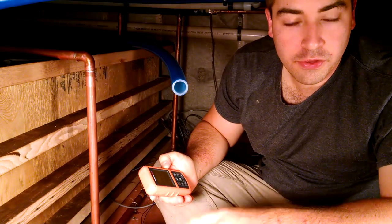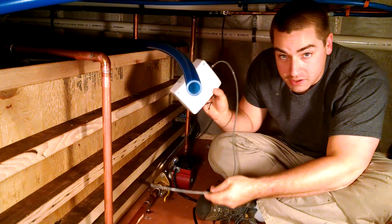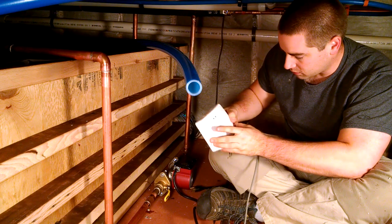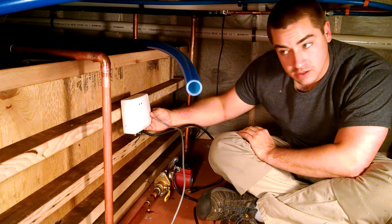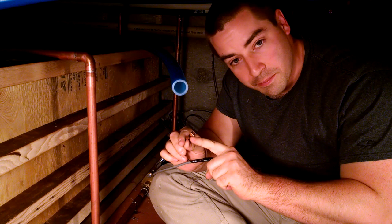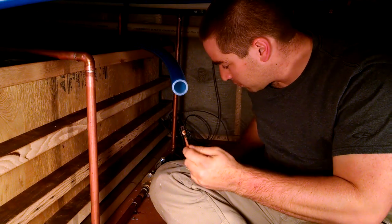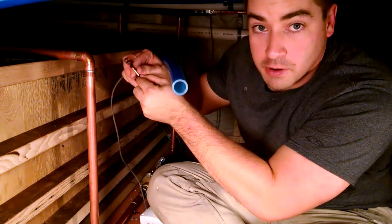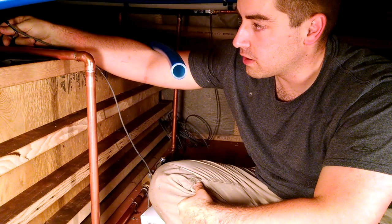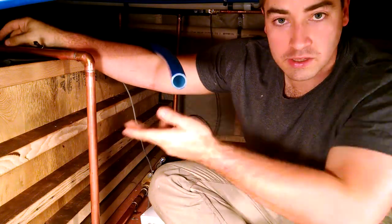I dropped a thermometer into the water, and it looks like we're currently reading 58 degrees. Over here is the controller — it's a very simple controller, and I'm going to wind up mounting this in this area, but I'm just so excited I want to get it going right away. This temperature sensor is not waterproof, so it can't go in the tank, which would be ideal. So what I'm going to do is get it close to the tank — I'm going to mount it just up here onto the copper pipe, which will conduct the heat from the tank. I'm going to be insulating over it, so hopefully we get as close as we can to the accurate temperature.